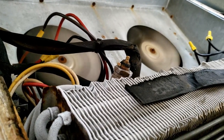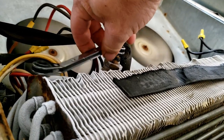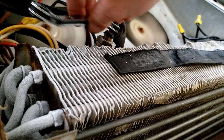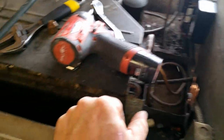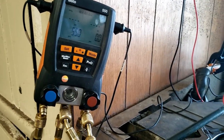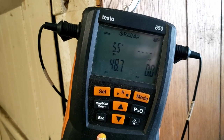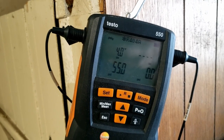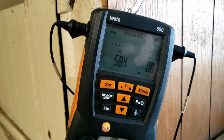I opened the TXV up a touch. Of course, obviously our superheat is going to drop — I almost had my setting on R-402, which is supposedly close to R-404A. We're going to watch and see what that does. It's coming back up now that it's got some airflow through the coil. Now it's going to hunt because it just all of a sudden got air movement through the coil — it's going to flood and go, flood and go. It'll settle down in a minute.